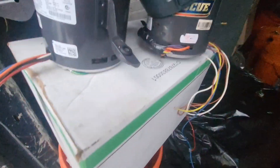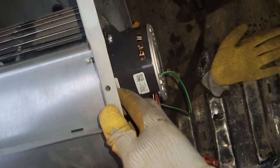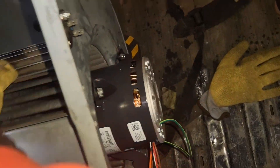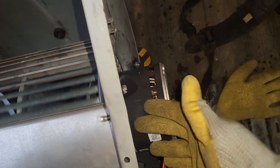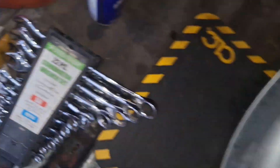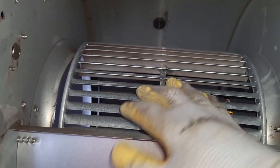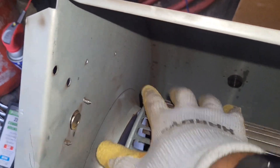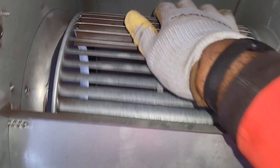In this case the bracket was loose, and I didn't want to take any chances. Even though I wanted to keep the same squirrel cage, I didn't want to risk reusing that motor. Nothing looked cross-wired or irregular, but I just didn't want to chance it. So I got the OEM. Here we are in part two — new OEM motor is in. I reused the same 3A screws from the old motor. The only two things I kept are the squirrel cage and the screws; everything else is brand new. Whenever you do any motor-related repairs, always replace the capacitor.